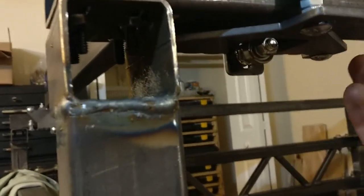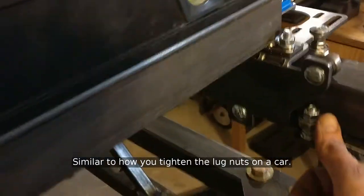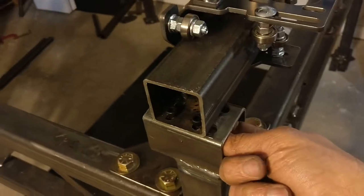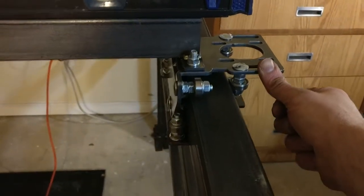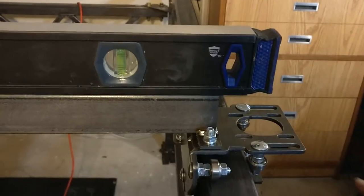I started with these two in the corners — just have them at the very top of their slot range and tighten them down. The next one to get was that one down there, and that was really crucial for keeping the whole thing from wobbling back and forth. After that I came in on these two, then this one, and lastly these two out there. Basically as I did each one, I would roll the thing back and forth a little ways to make sure the skateboard bearings were actually engaging. Throughout this whole process I had the socket cap screws installed with the nuts loosely to keep the thing from falling off the table. As for how stiff the rollers should be — the instructions didn't say — but I made them pretty stiff. I can still move it with one finger but there is some resistance. It's better to have the motors work to overcome that resistance than to have the whole thing loose and flopping around.